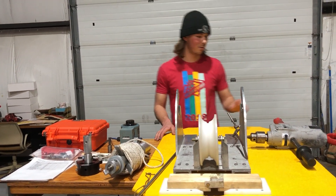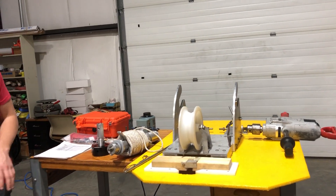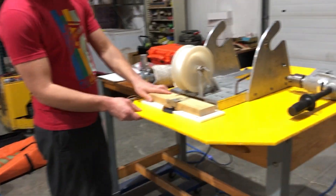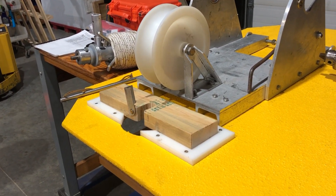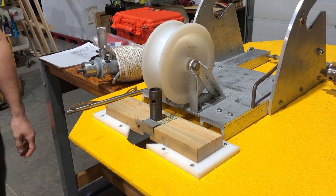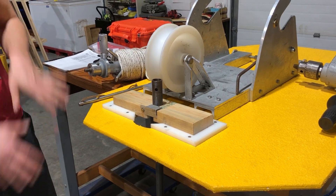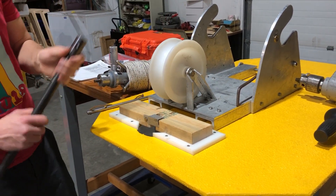This suspension supporter is standardly shipped with one of our IDDO systems. It's meant to integrate with the Sidewinder platform to capture your extensions when you're drilling. This guard closes, and say you're coming out of the hole and need to remove an extension and break that connection — you can first install this piece to support your drill string down hole so you don't lose your drill when you're tripping.